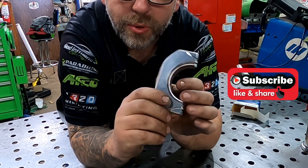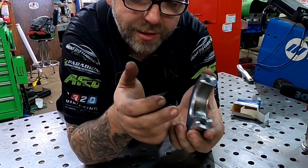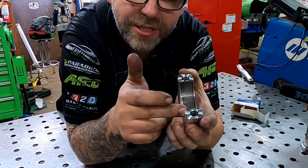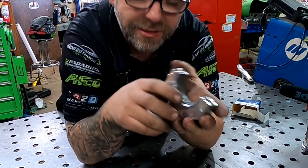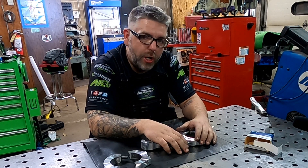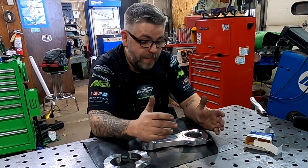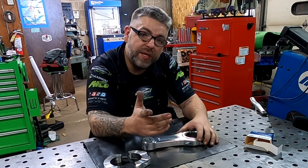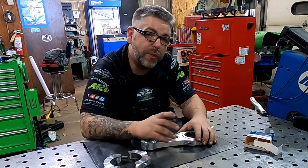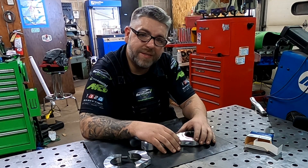This is also going to help make sure we don't have anything running into the crank causing extra friction. If we get too much friction on that bearing edge we can actually put heat into it and take out a rod bearing — and it might not be the bearing's fault at all, it'd be ours. So there we have it, guys. I'd love to show you all of them but I've got a bunch left to do. Thank you for watching and subscribing — I hope you enjoyed this. This is just one way to narrow a set of bearings; if you have another way, tell me about it in the comments. Make sure you visit the website at www.badinfluencegarage.com, and until next time, be safe out there.